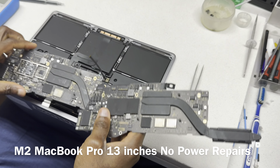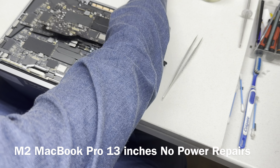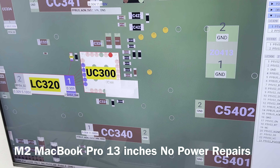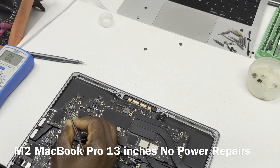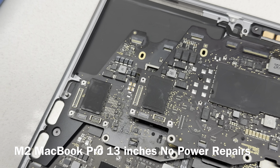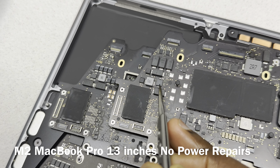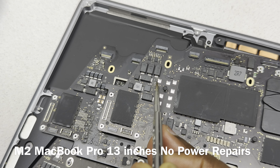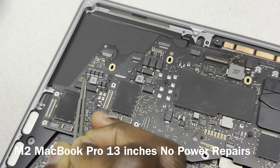If you haven't seen the board number yet, another thing to look at is the 5-volt regulator IC, which is UC300. Look at the type used here and the one M2 uses — it's slightly smaller. M2 is smaller, M1 is bigger. So even without seeing the board number, if you look at the 5-volt regulator IC, it is bigger on M1 and smaller on M2.